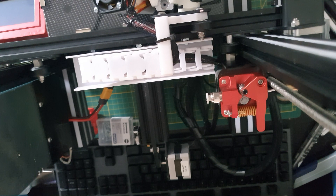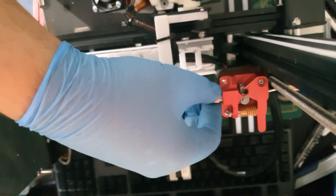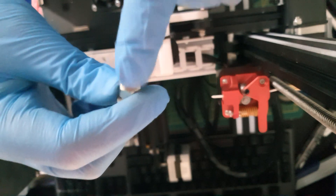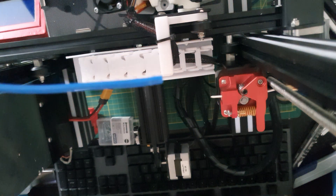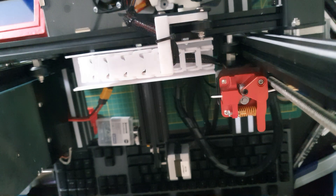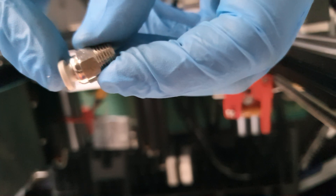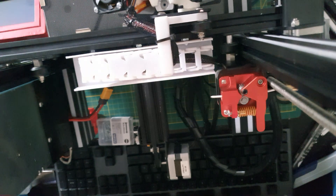You will need a few things. First of all, you will need a very specific coupler. There are two versions of the larger diameter coupler - the smaller ones should work as well, you just have to drill out the diameter of your tubing so the tubing goes all the way through your coupler. You will no longer rely on the gripping force of the fitting alone.